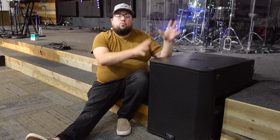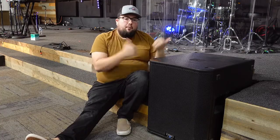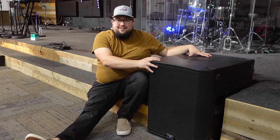You're basically needing to treat this as a part of your sound system. It should be treated as one part because they're doing the job together, because you've already set your processor to make everything work together as one. So by using your high pass filter, we say, hey, you don't need to worry about sending it to the sub, just send it to the mains and it's going to sound great because it's already tuned correctly and we know it's going to work.